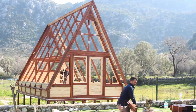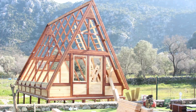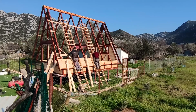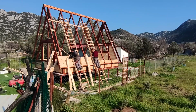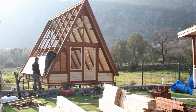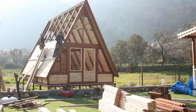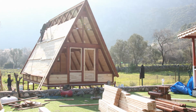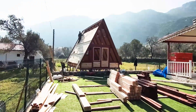After the top beam is installed, we move on to the assembly of eave plates at the front and rear. As you can see, A-frames are mostly roofs. We have about 900 square feet of roofed area to install. The highest point of the house is about 22 feet from the ground, so some planks need to fly. We are lucky to have experience at throwing and grabbing them.